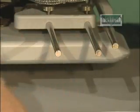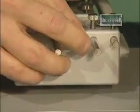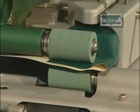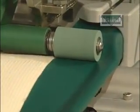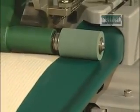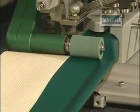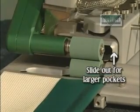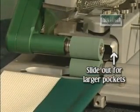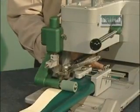Removing the overlap guide will allow for the use of the hem guide for the production of hem-style welds. The formation of the hem will leave a minimum size open end to the folded over edge of material. This open end can be adjusted to make any size pocket that may be required. The inner edge of the wedge housing can be used in conjunction with the hem guide to make for a specific pathway for the material to travel and further assure an accurate diameter pocket size.